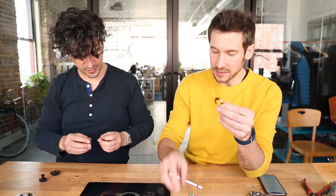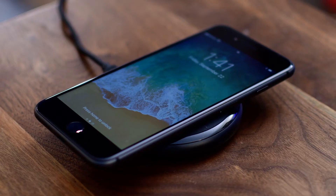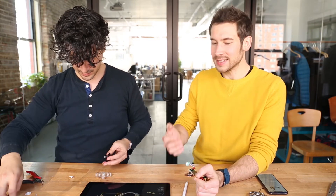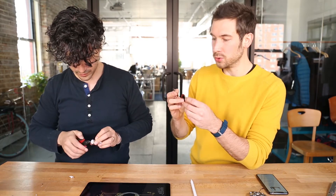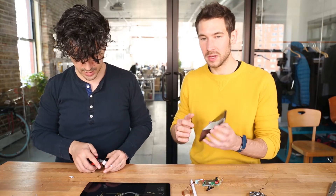Let's talk about where else you might find something like this. The Apple Watch uses the same technology, and now your Apple iPhone — it's Qi charging. There are also some disadvantages to wireless charging: it's not as efficient as plugging into a USB jack. You get leaks, and you're also losing energy to heat because of resistance in the coil. There's also a material mandate to avoid metals — you couldn't charge through a metal housing, so you have to have plastic or glass. In the case of the iPhone, that's what required them to have a glass back.